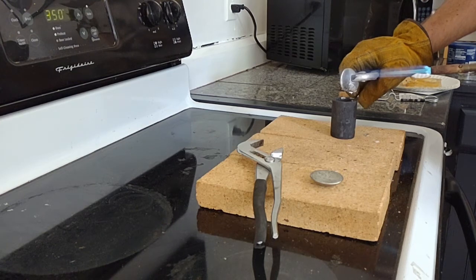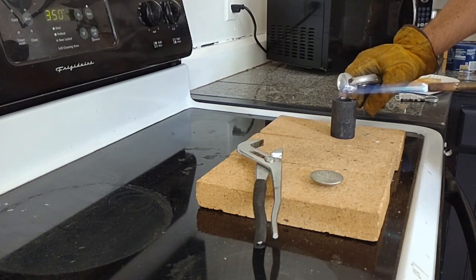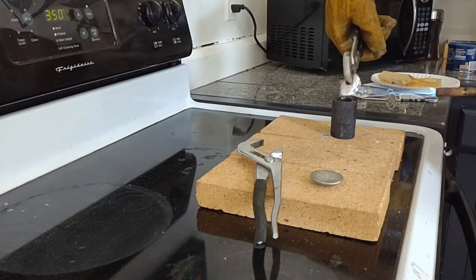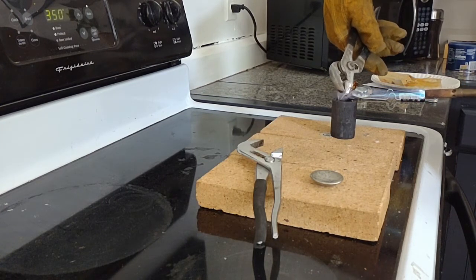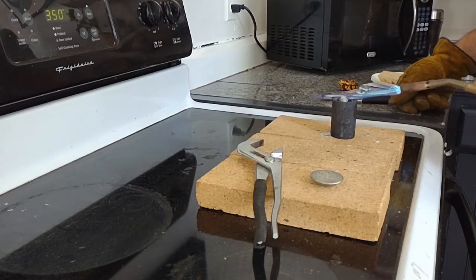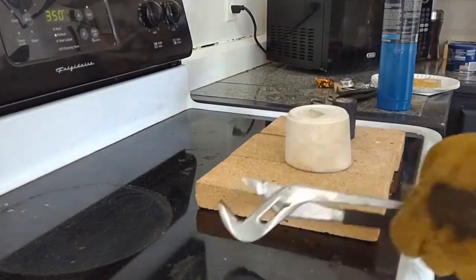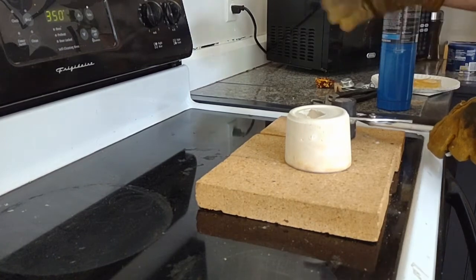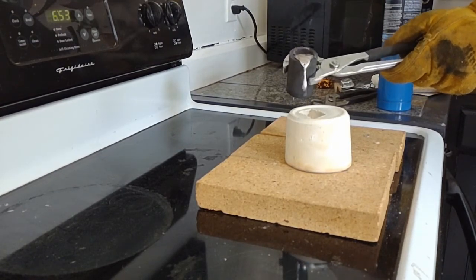As you can see, I have my special laboratory here — the kitchen stove. I put a couple of heat bricks down on the bottom of it just to be safe — or at least safer. Another cool part of this is that the composite mold that we melted out of the plaster mold can be remelted and reused in other molds as well, and that would also work with wax. You also want to heat up the plaster mold before casting — put it in the oven at temperatures well above 300 to 400 degrees Fahrenheit so that any water in it will be dried off. Then carefully pour the metal into the mold.